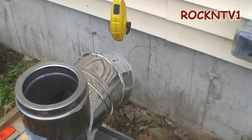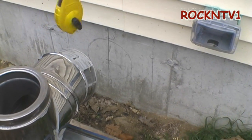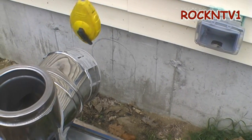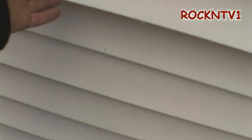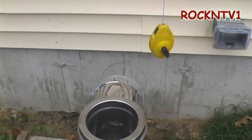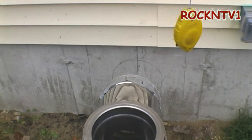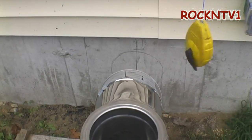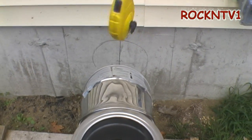The reason I have not made the bracketry yet is because I only have about a 16 to 18 inch span before I get to my vinyl siding. What I did was peel up the siding a little bit and find the middle of the wall studs, so that when I go to hang my bracketry — which I also have to make — I'm lined up properly. So I have to drill through this concrete on an angle.